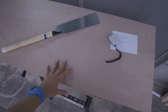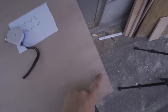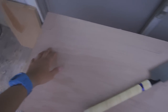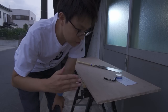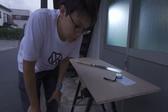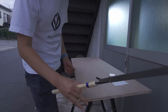Now we're at the board for the bottom of the stand inside the cabinet. I've marked out the areas where the 2x4 supports are located, so I've got to cut these all out — all four corners as well as the middle for the center brace or center supports. I'm going to cut that out using the hand saw. The reason I decided not to use the circular saw is because that thing wasn't cutting straight at all. I'm not sure if it was my technique or a problem with the circular saw, but I've resorted to using the hand saw. It's more accurate and it's also quite fun.